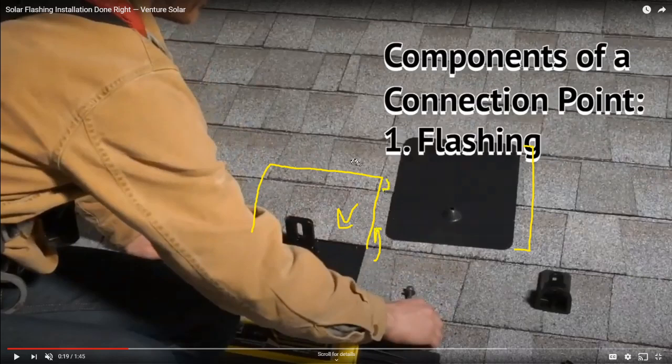And so any water that's not just on the immediate next row of shingles, but even the one that's another layer up, is falling. If water gets into these gaps between the shingles, it's not supposed to, but if it does, it falls onto this flash pad rather than getting underneath the rooftop. So that's actually one of the most time intensive processes on the job. You'll get a little pry bar to stick up underneath these shingles and pry up any roofing nails so that you can slide the flashing all the way under.